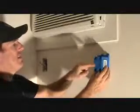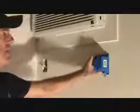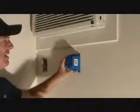because I've got to come into the switch or this timer first, I could take the plug out and I could put a cut-in box right here. I could put it over here, wherever. I could even put it all the way over there if I wanted. Well, take that back. If it was right there, I'm either going to have to put it fairly close to this before the next stud, or if the stud's fairly close, I could drill through that like I was showing you, and I could put that over here, and then I could put the timer here, and I could put the plug over here, because I'm going to reroute the wires. Do you see what I'm saying?